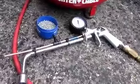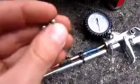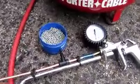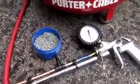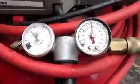All right, so here goes our shooting test. I forgot to mention — I'm basically just using these ball bearings that can also be purchased at a hardware store for ammo, but they're equivalent to .177 caliber BBs for your BB gun. Our air compressor is currently unplugged but I have the tank held at approximately 100 psi, which is what we will be using for this shooting test, and we will be shooting at that little pizza box over there, then maybe bug spray and a little tin. Let's go ahead, load it up, and see what we can do.